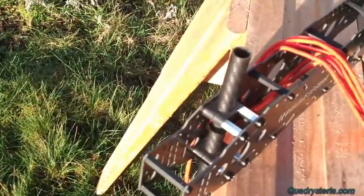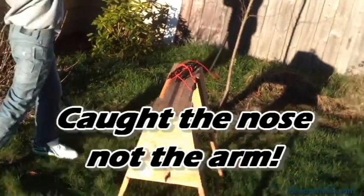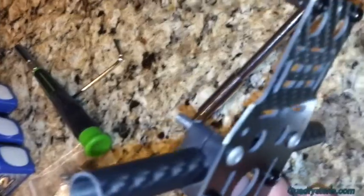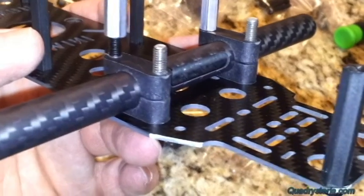Next we are testing a swing on the arm. Eric, ready to go for the arm? He's going to take a swing at the arm with nylon screws. My son hit it pretty hard — you can see a little bit of the bat scuffed on the edge of the carbon fiber, so he didn't actually hit only the arm, he hit the frame plate as well. One thing that was really cool and pretty surprising was that these glass-filled plastic arm clamps did not break at all — just the nylon screws. So I'm reusing all the same standoffs.